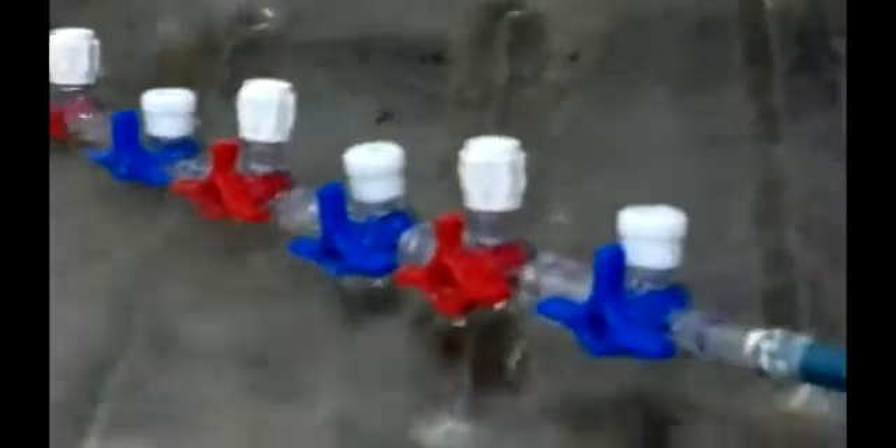There is no leakage up till now. This experiment shows that even after giving 6 bar pressure, it is running successfully — it can sustain the pressure up to 6 bar. Even though we can increase the pressure further, our purpose was to show that even when we exceed the recommended 4.5 bar up to 6 bar, there is no problem.